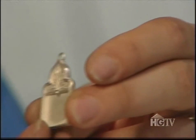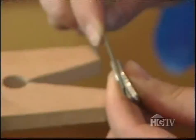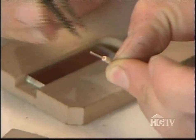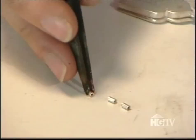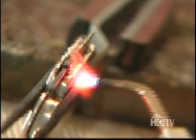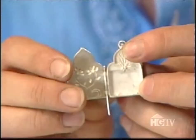I'm going to attach a hinge — I file a little groove in here and then I cut five pieces of tubing equal length. I'm going to put the hinge pieces on a piece of wire with a little bit of nail polish in between so they don't get stuck together during soldering. I'm going to place those hinge pieces on a wire right in the groove and solder the pieces to the front and the back. Now it opens — all the moving parts are working and the hinge is nice and tight.